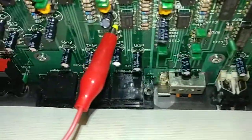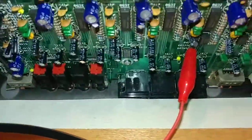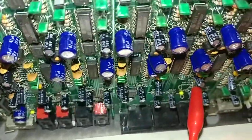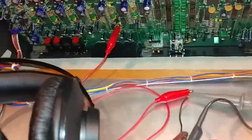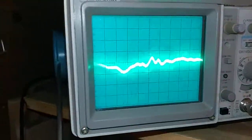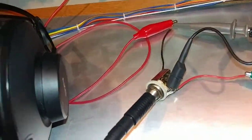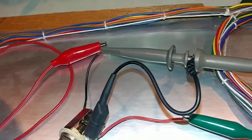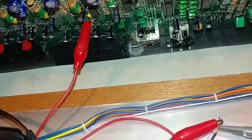Test point 5 is one you're supposed to use when you go into test mode and program a single square wave to be played. This one won't play a square wave, so that became kind of irrelevant quickly. But since you can watch the sound on the scope, that means you can listen to it. I connected a pair of headphones into the same circuit as the oscilloscope — the headphones are essentially jacked into test point 5 and ground. So now you can hear this madness.